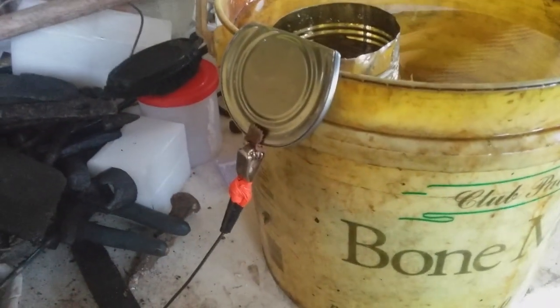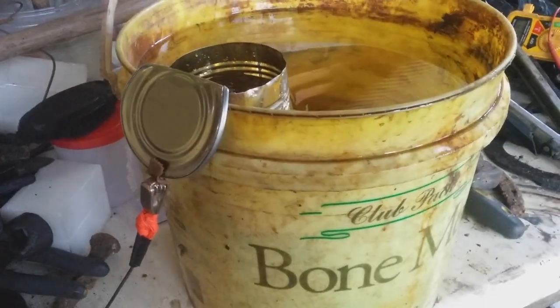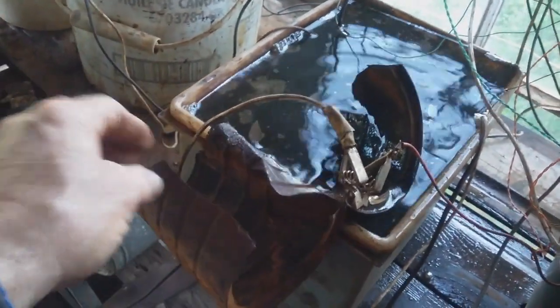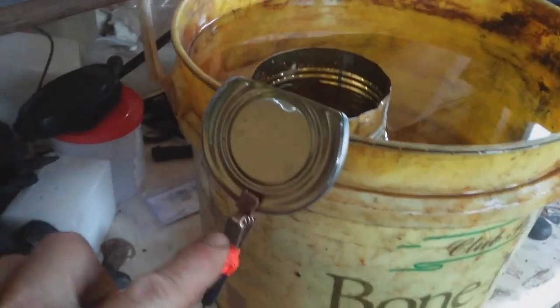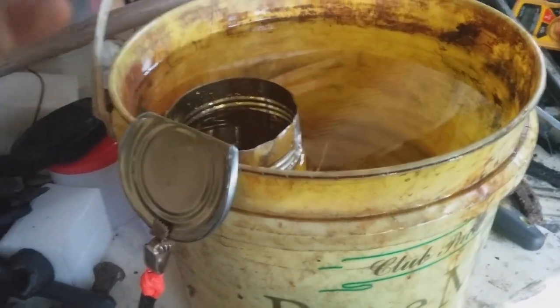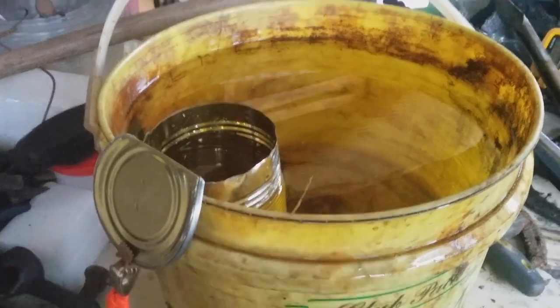As I said, the positive has to stay outside the tank, not in contact with the water — otherwise it'll turn out like this, it will just fall apart. This is the contact and the positive goes here, and over time this will disintegrate.